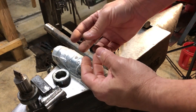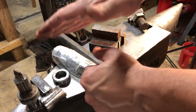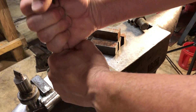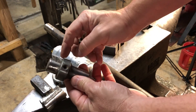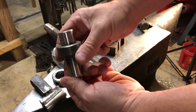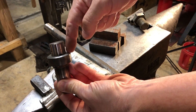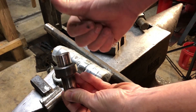When you're using the FlyPress, the upper tool in the top ram needs to have a collar, washer, or something to sit against. So if this fist is the ram, your tooling is going to fit in the bottom of the ram and it needs something like a shoulder to sit against. I use these collars on one-inch round stock as the shoulder to seat the tool into the FlyPress at the proper depth, letting the force of the FlyPress ram rest on the collar.